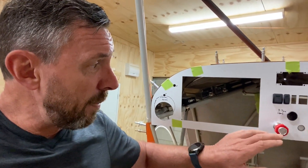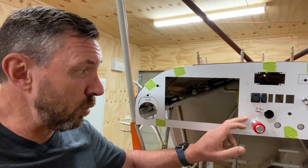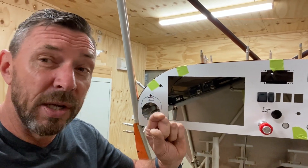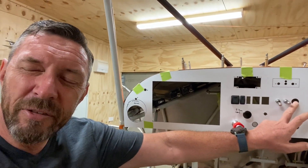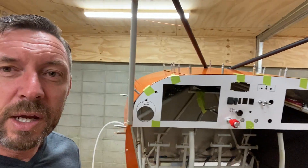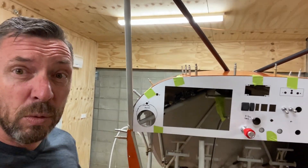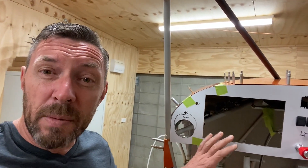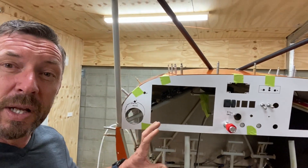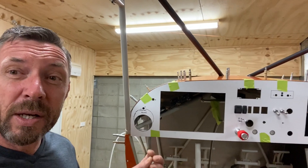As a result, the holes cut out for the cabin heat and park brake are going to clash with the air vents, so we're moving those to a new position where they fit quite nicely. There are a couple we got wrong — the throttle cutout needs to be slightly smaller, and the starter button hole needs to be widened out about half a millimetre. We're going to do one more trial run with another mock-up panel to ensure the fit is correct, then drop it somewhere that can do a laser cutout on the actual aluminium panel, install the nut plates, and get it powder coated.